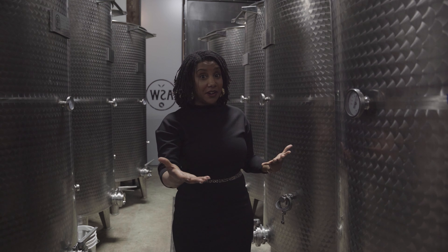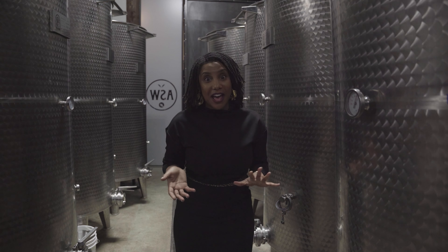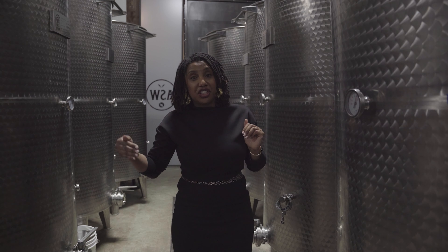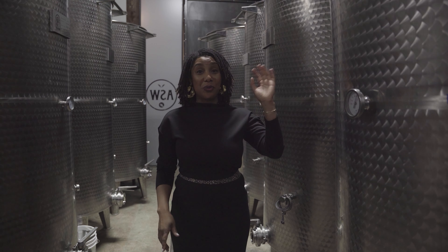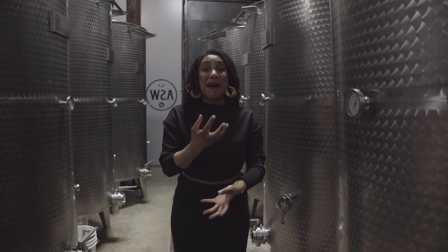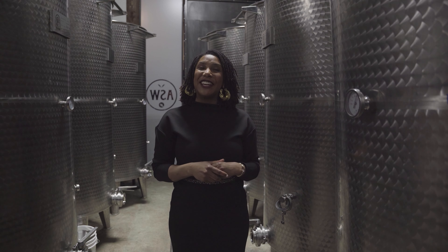Hopefully your fermentation doesn't go too far with too much lactic acid, but sometimes some of those lactic materials can give you some really beautiful flavors. We typically go about three to five days for fermentation. We don't want it to get over about 95 degrees Fahrenheit — you'll kill your yeast. Our pH should stay around five to four; once it starts to go below four, we know we probably have something going on. We went from grain to grist to mash to fermentation, and now we're at about eight to ten percent beer and it is time for the still.